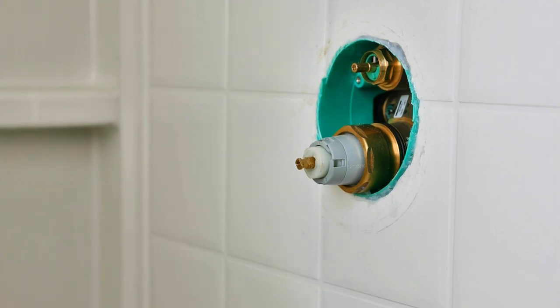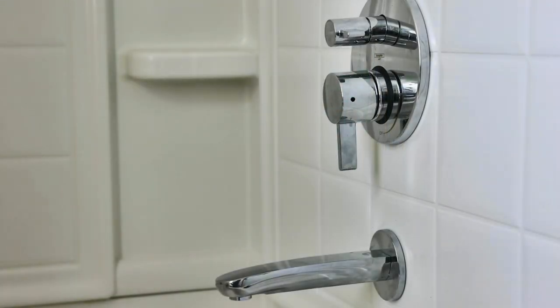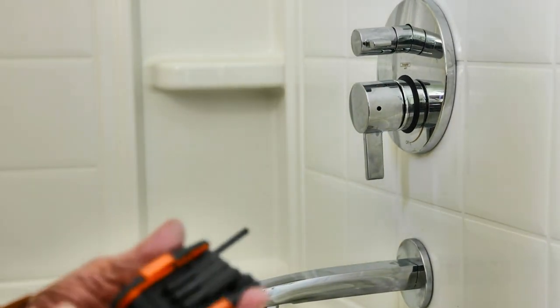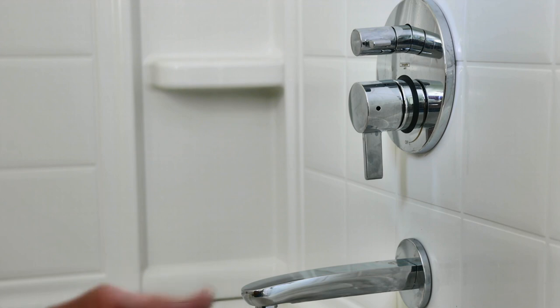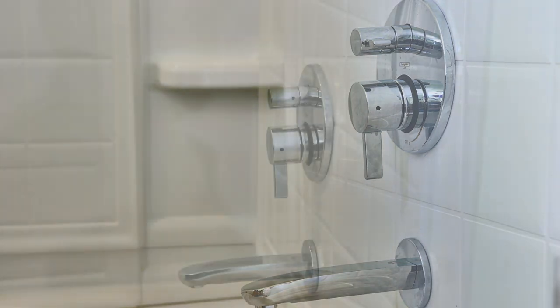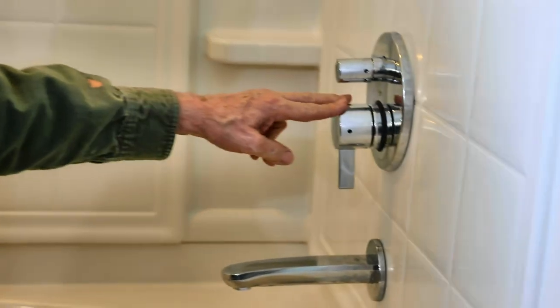So I'll put some more pieces on. There's a few more pieces installed. The back plate and trim sleeves around the mixing valve assembly. Okay, that is the valve pretty much assembled. And we need to keep in mind that these pieces go on with Allen screws, and they're metric, so you need to get metric, not US. This is a Hansgrohe valve that replaces an inexpensive cooler job.